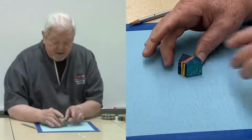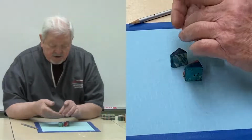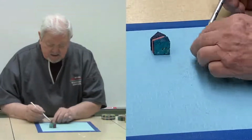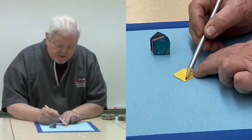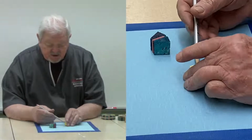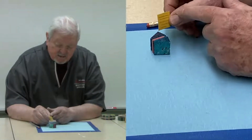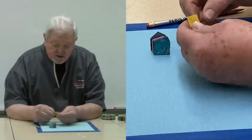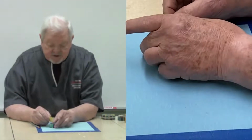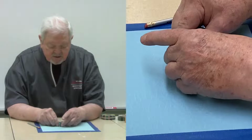But with veneers, I have to cut it so that these veneers work. Now, take one of these little pieces out for a second. The grain in this piece of veneer is running this direction. If I put it into my assembly this direction, I'll be exposing end grain. So I want to put it in so that the grain, in this case, runs vertically. Now that's against our flowing grain, but this is the only way I can have not end grain showing. The veneer has to be put vertically.